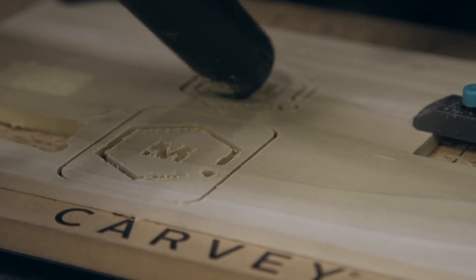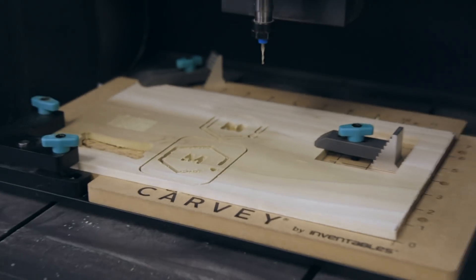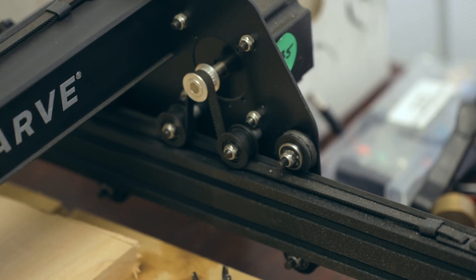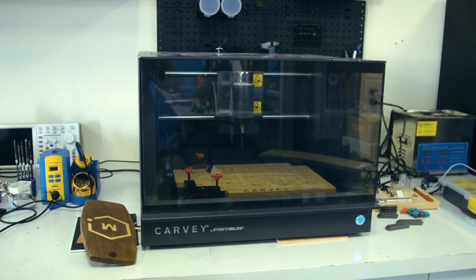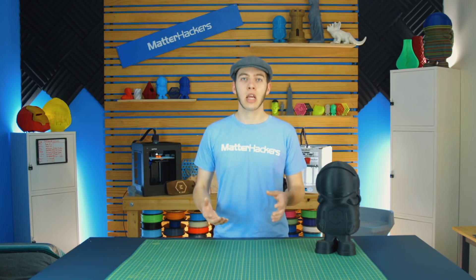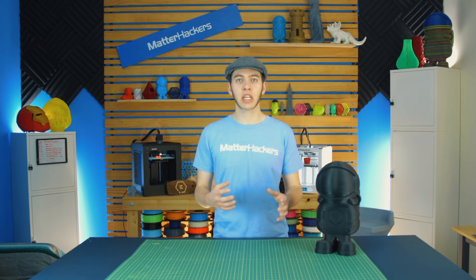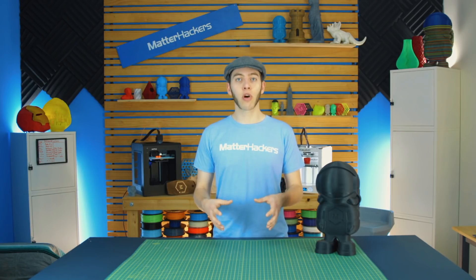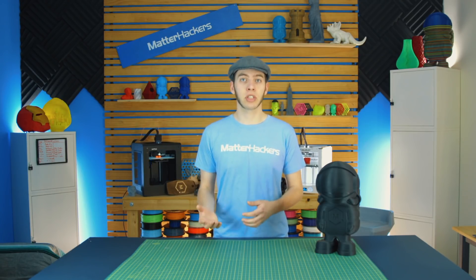Now there are different forms of 3D Carvers. Some are designed to be put in a classroom or a small space where you don't have a huge dust collection system, or there are others more designed for workshops where you can have a big cutting area, but it's a little less refined. One of the first forms is the desktop style, where it's enclosed in some form — whether plexiglass or a metal frame held open with hydraulics — designed for plug-and-play ability. You unbox it, everything's guided, it's pretty easy to set up, but it will be a little more expensive. They also tend to have a smaller work volume, but the same material capabilities as the bigger ones.